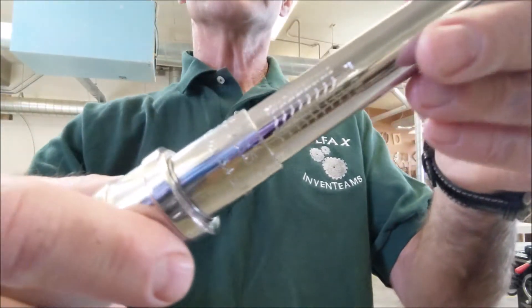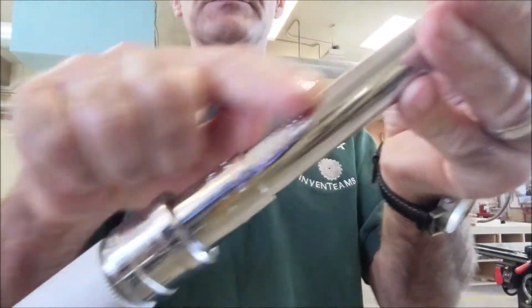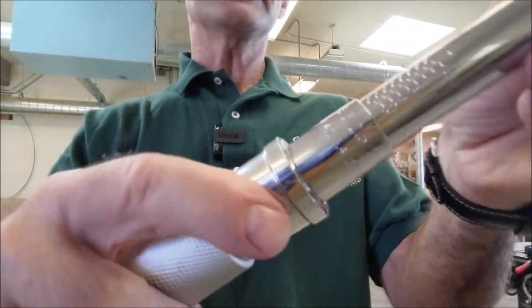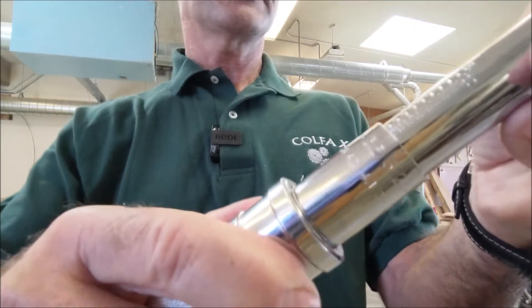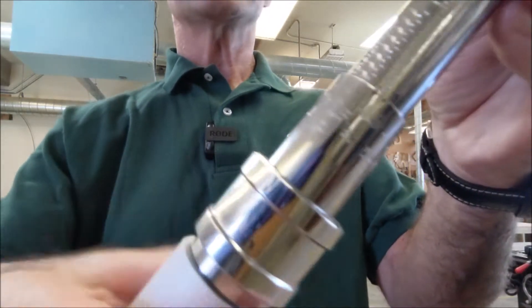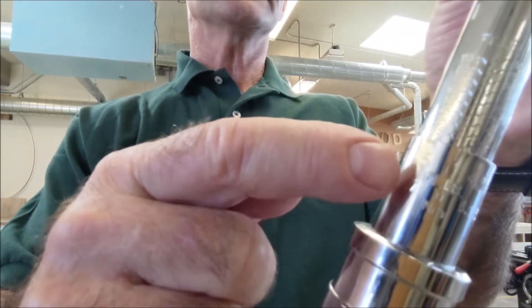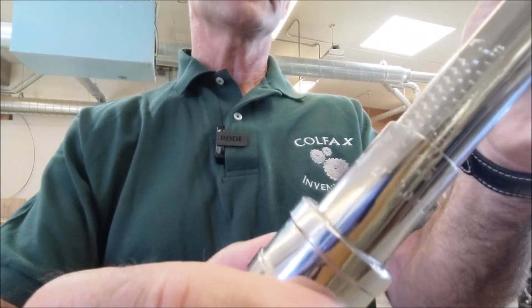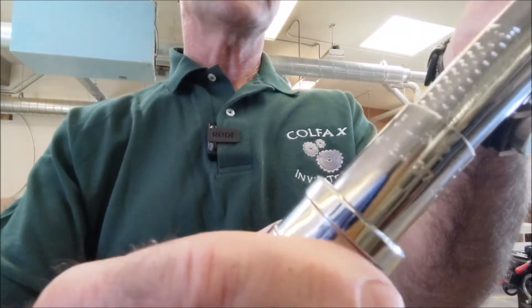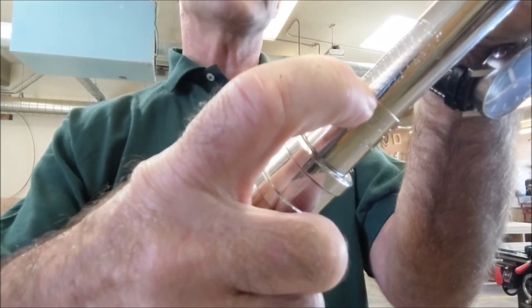To set the foot pounds on this torque wrench, you pull back the handle and spin it freely — as you spin it, you're tightening the spring inside. Let's say I want to set it at 20 foot pounds. I'm right on the bottom of that mark at 20. If I want individual units, I turn it past that — one little mark is one unit. So 22, 22.5, 23, 24, 25 — and it's a zero mark because I'm at the next increment. Now I'm at 25 foot pounds.